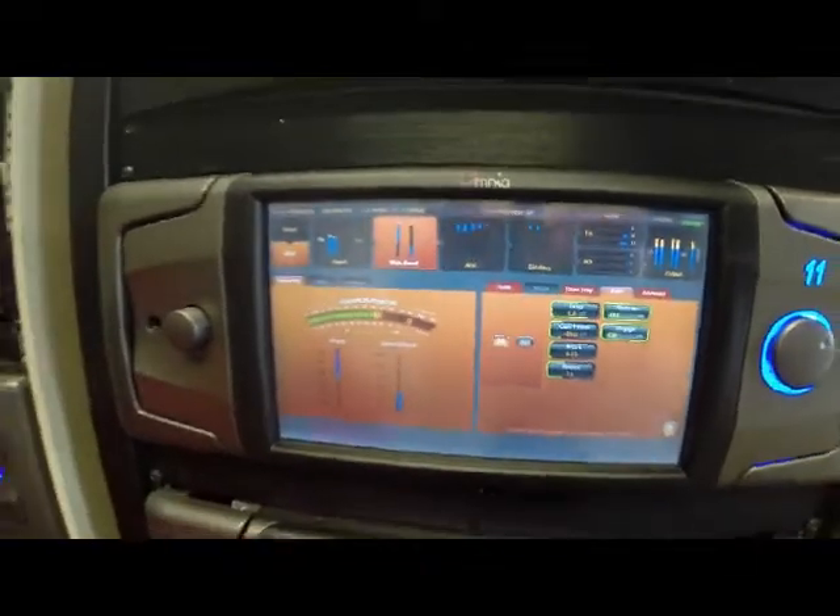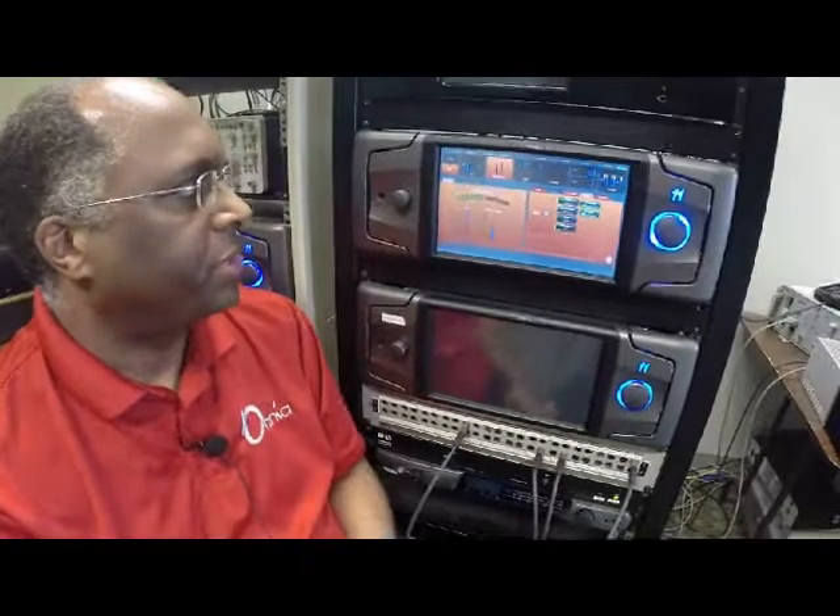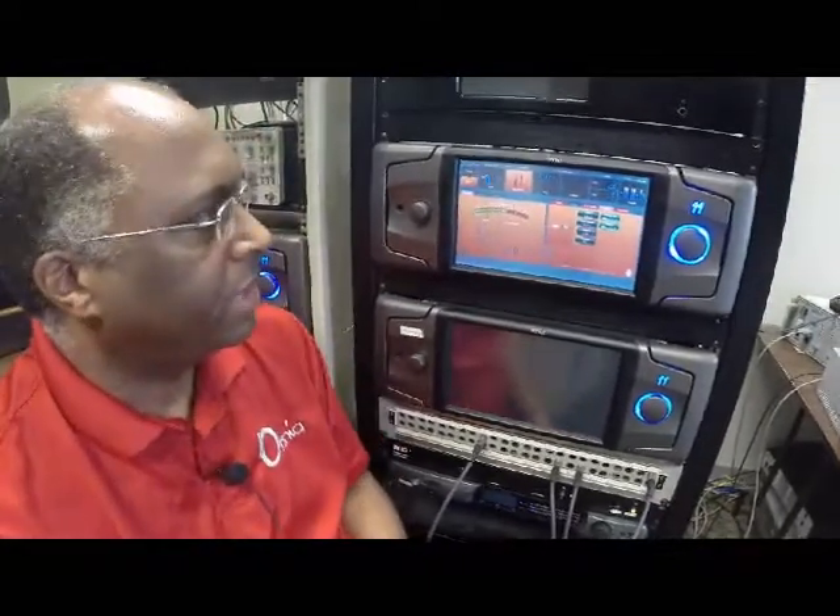One of the things the Wideband AGC is capable of doing — and this is where we start getting into some of the Chameleon Technology — is that it's capable of analyzing the density in the audio content coming in. For really dense material, it knows to back out of the parameters a bit to make it sound more relaxed. That provides consistency when going between content that's not as processed versus content that is. Content that's not as processed will trigger a mode where the Wideband AGC does a little more processing to even out density variations. For really dense material, it knows to back off and not do any more damage than what's already been done in the extreme mastering you see on some content.